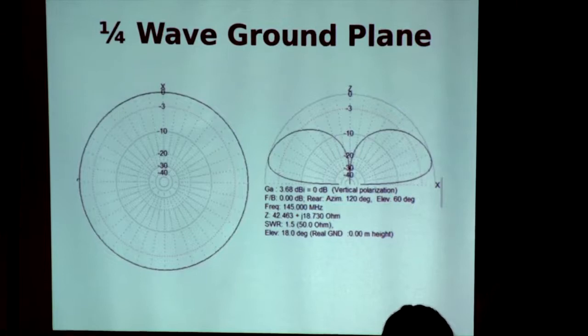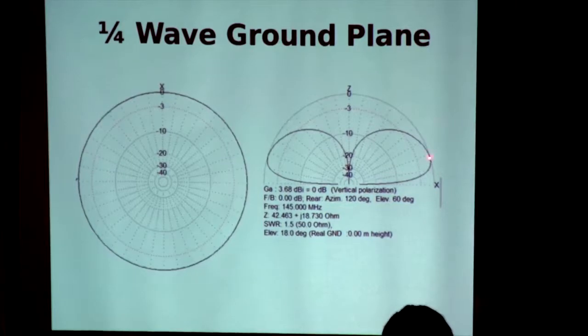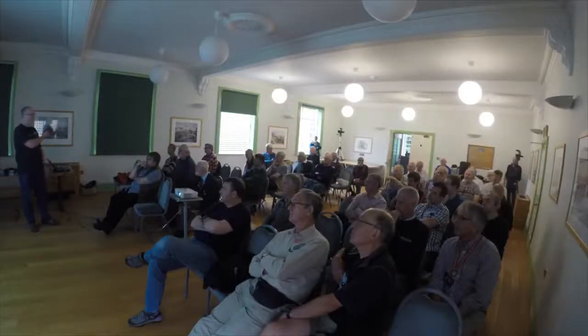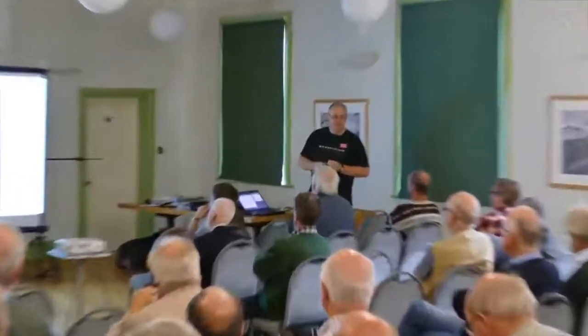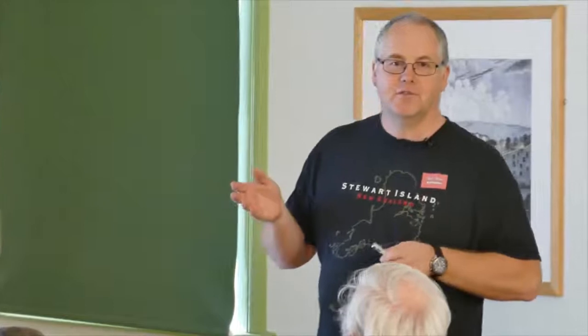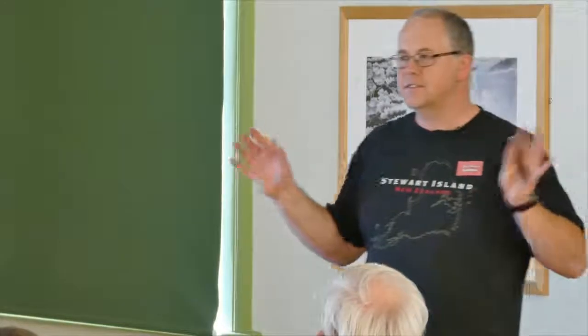You can very simply model what your antennas are. Everyone knows a quarter wave ground plane transmits and receives in 360 degrees all the way around. If you happen to have a good ground plane, this lobe drops down towards a much lower angle of radiation. Some purists say unless you're at least 1,000 miles away from home it's not DX and it doesn't count — likewise if you're not in your own DXCC.